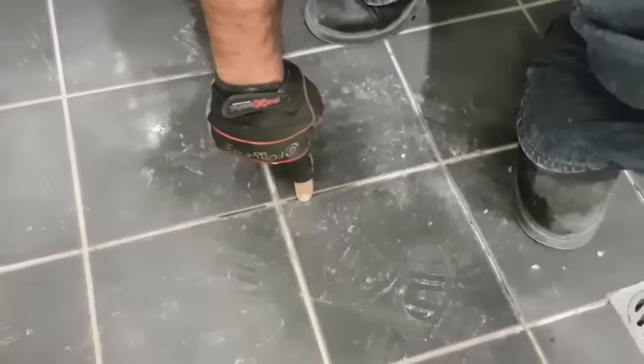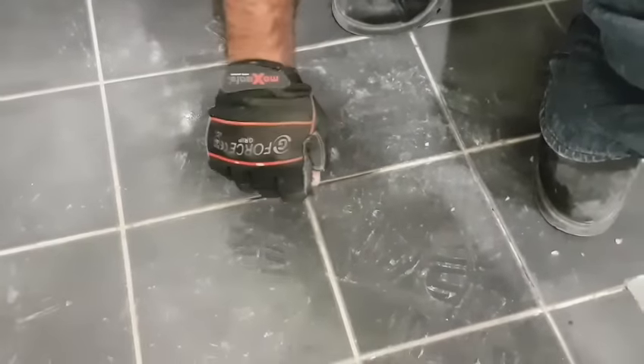On this side here you can see that there is major cracking all the way down to the floor. And if you look at the grout at the bottom you can see how the water has worn it away — the grout is pretty much gone. Water gets in there and it starts deteriorating everything underneath, so it is very important that you detect them.